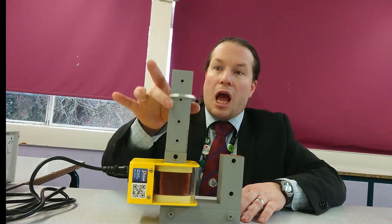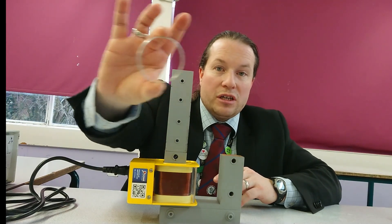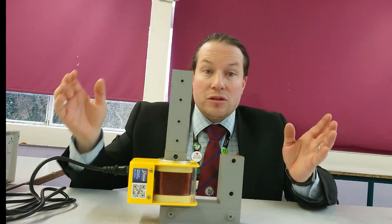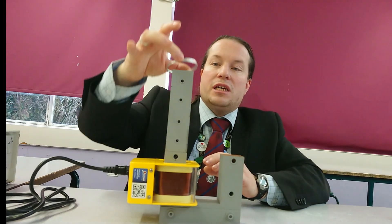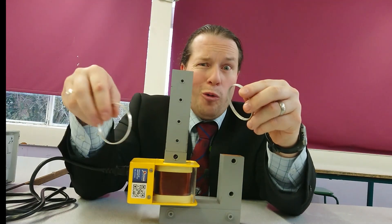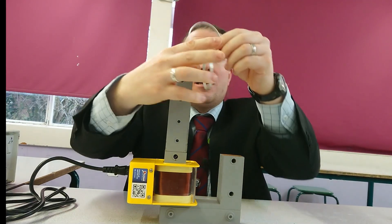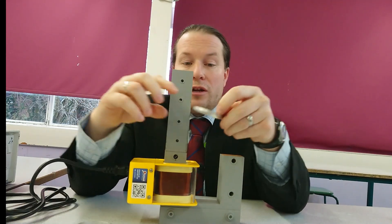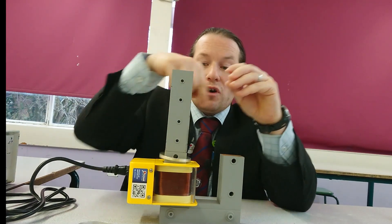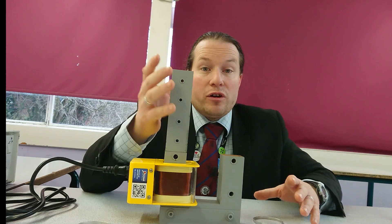This gets quite warm. Now we're going to try it again, but this time with this other ring — watch closely what happens. We expect it to levitate, but it doesn't. Why? Well, this is one of those magic rings. If we connect the two rings together, it's all just science — we've got a split in our ring. So when we drop this split ring on, we've got no induced current flow because we haven't got a complete circuit. So that shows you that we do have a magnetic field there, but a complete circuit is required for current to flow.